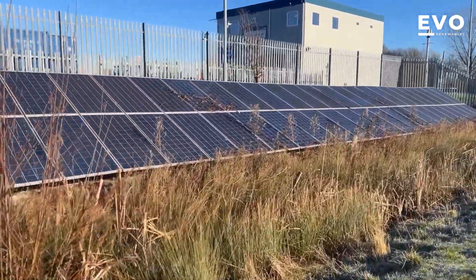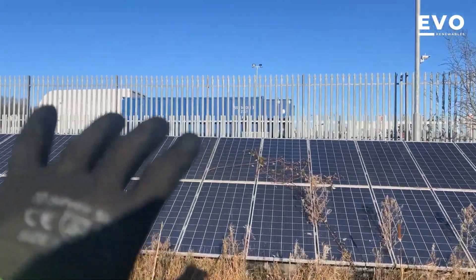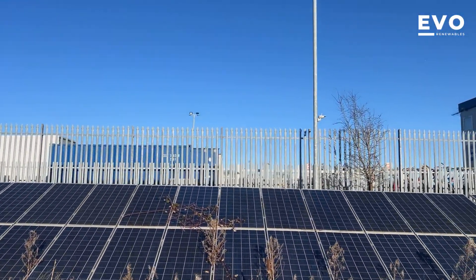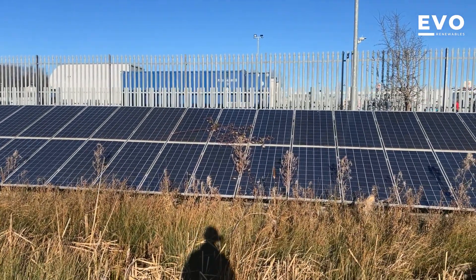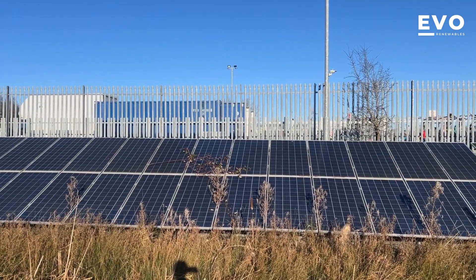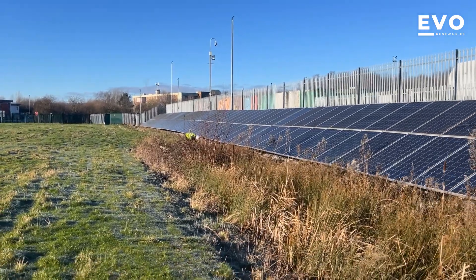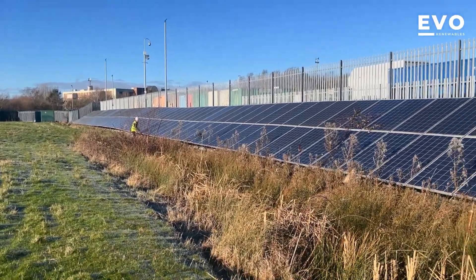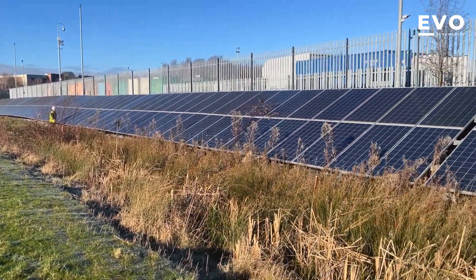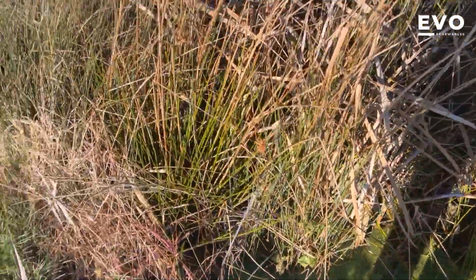And I know I harp on about SolarEdge, but all that growth there is going to be affecting a whole bank of panels — not just the ones with vegetation on them, it's going to affect all of those in series. SolarEdge would help to mitigate that. If you're going to go for a system especially of this size, it's probably worth going for optimizers: you're going to improve your generation, your safety, and it's going to help with issues like shading. There's actually a bog here.